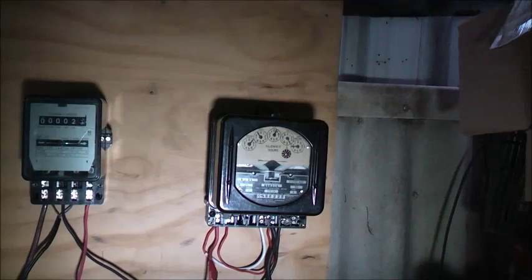I'd be all right because they're together — 25 amps each, so I could put 50 amps through that safely. If it was 2 times 12.5 amps, that'd be 25 amps altogether, no more than that. There's a way I've wired it up for single phase only. I could put 50 amps through this meter safely because both load coils are wired together, so the load splits evenly between the two load coils.